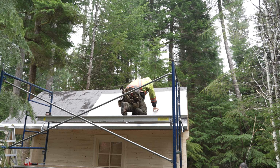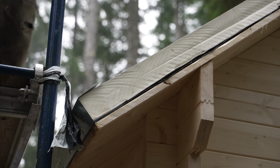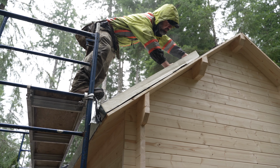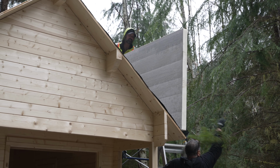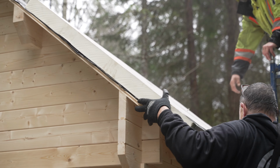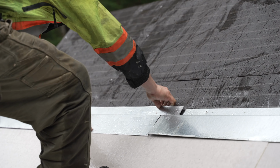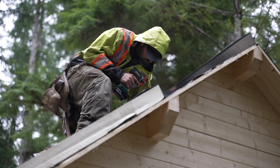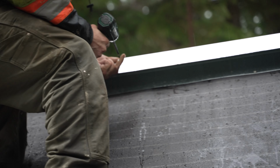Slide insulation sheet into the U-bar snugly. You may need to cut the insulation sheets to fit into each U-bar and to cover the roof. Install metal Z-bar on top edge of first pieces of insulation. Again, you may need to cut to fit the length of the roof. Install another metal U-bar on the peak edge of roof and slide in last pieces of insulation to fit.